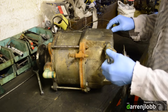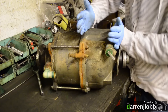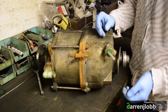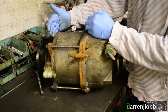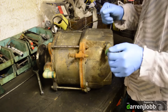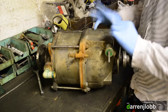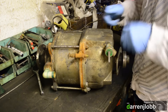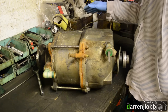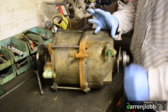Under this alloy cover is the stator and rotor housing — that's where the main action goes on. This section over here is a big heat exchanger with lots of copper coils inside, so that's where the heated water from inside the brake is circulated. You have a main in and out on each side — that basically takes the heat away because you're absorbing a huge amount of energy here and it has to be converted into something, in this case heat.